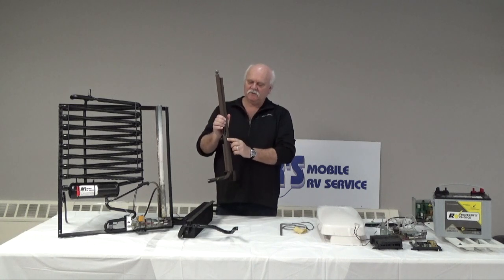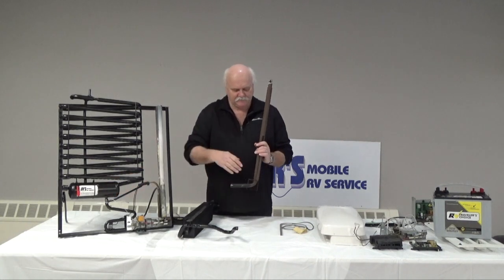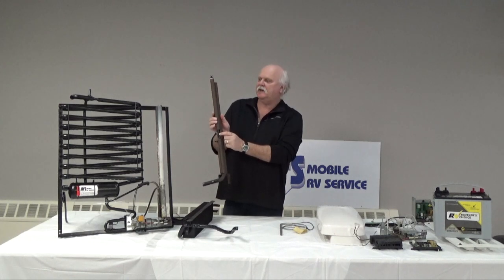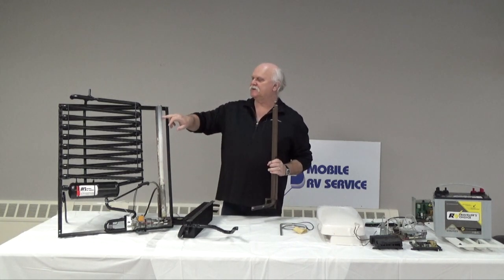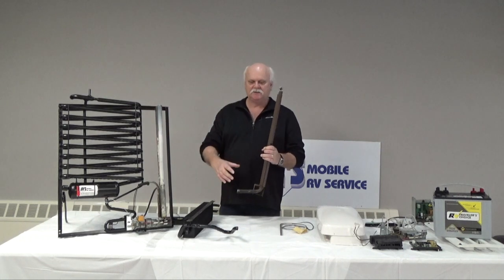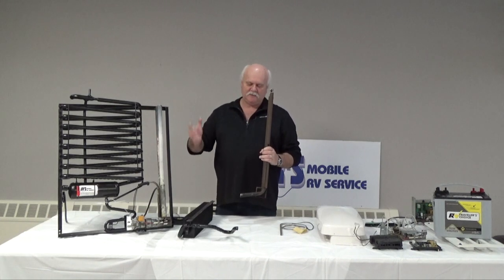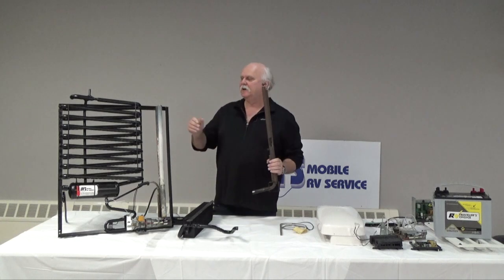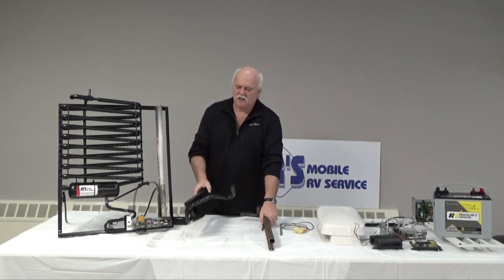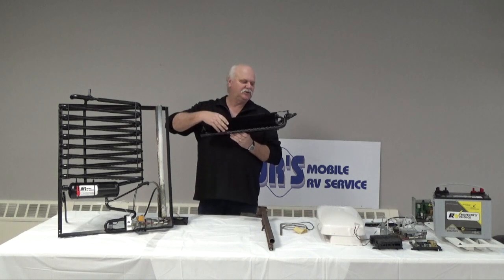When the heat's transferred to the pump tube, there's water in the boiler in this. It boils the water, and pushes it up. You can see a small tube on the inside, which is this. It pushes the water back up, because it will evaporate and push. And as it's pushing, it's starting to move the ammonia, which is based at the top, which is the fins. You would see these on the back side of the fridge.